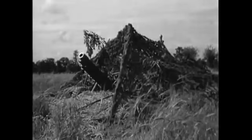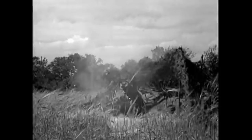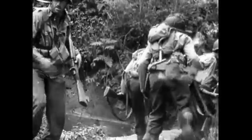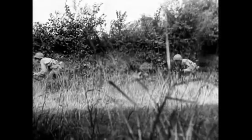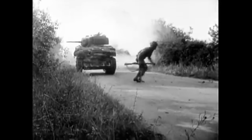Mounted at the rear of the hull, the new turret was large and boxy. Unlike the Conqueror's cast turret, the FV-215's turret was to be of welded construction. Existing dimensions list the turret as 12 feet wide, sitting on a 95-inch diameter turret ring. Overall, the turret would have weighed 20 imperial tons. Unfortunately, the exact thickness of the turret armor is unknown, as records list the turret face only as 'will protect from 100mm gun in a 30-degree arc.' The rear of the turret and roof would have been 0.6 inches thick.